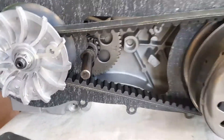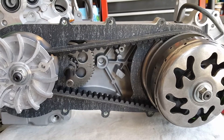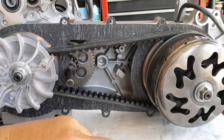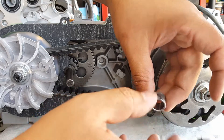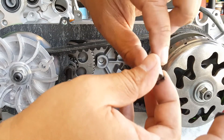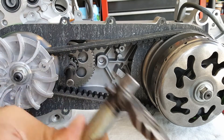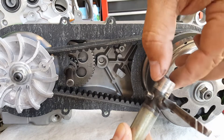Get a good angle on it with the light so it's more visible. We're going to apply some moly graphite grease — just put it thoroughly in there. It can go on both sides, on top as well as the inside. The inside is hard to get to but you can use the tip of the applicator and it'll work the same.